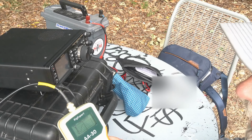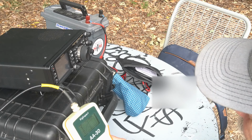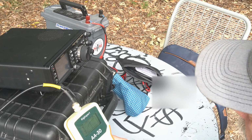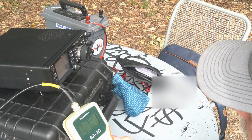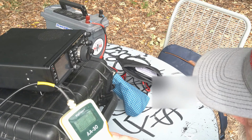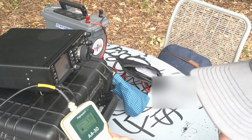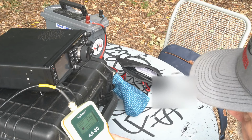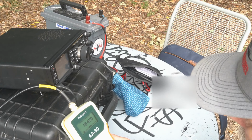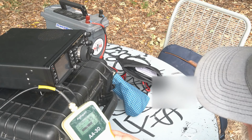Yeah, I'm really long. I just cut this wire at 64 feet, and on 40 it's way long. It's like 6.4, 6.47, 6.5, 1.17 there. So I'm too long. I'm gonna have to shorten this thing probably. Let's just check the other bands out. Meter, yeah, 4.3 again. I bet it's long also.